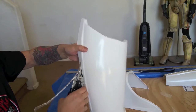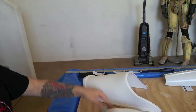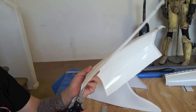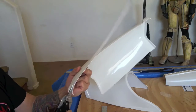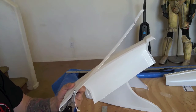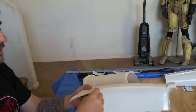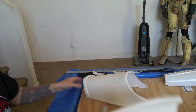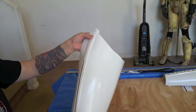You've got to be careful with these tin snips. I've had a friend that came over to build armor, and when he was cutting he accidentally cut himself. So if you use that other hand to help hold the part up, whatever you're cutting, just make sure it's not in the way of these tin snips — they have serrated edges, so they'll go through metal and easily go through your skin. The cut-off piece is too small, so I'm not going to use it.